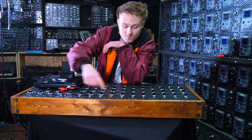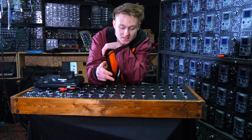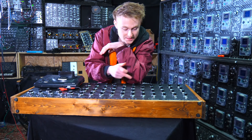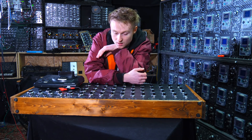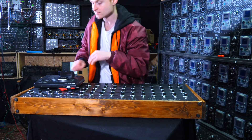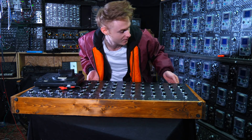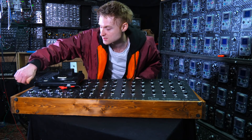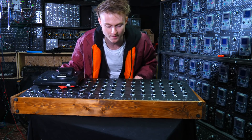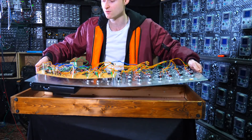You could change the MIDI channel, but I still haven't figured out how to give it a poly mode, which would replicate all the CC commands onto all channels. I can't do it without messing with anything else. So if you want to solve that - the last switch on this rotary switch is digital pin 12 - if you want to make that do omni mode, that would be much appreciated.